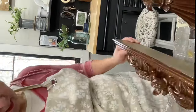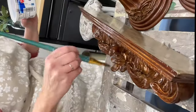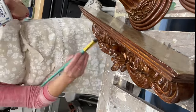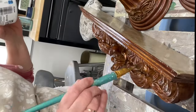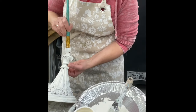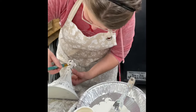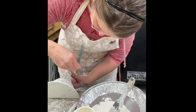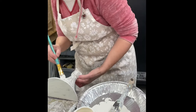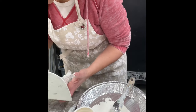To finish the shelf and corbels we used a school glue paint crackle method. You can use regular white or clear liquid school glue — either one works. We painted a layer of glue onto each piece and waited for it to dry just until it was tacky. We then painted all the pieces with Waverly chalk paint. To get more of a crackle effect, Julie dried the pieces with a heat gun. The faster your pieces dry, the more crackles your paint will have. Once the paint is dry, we waxed the pieces with a clear wax.